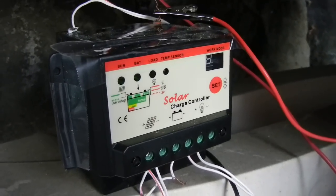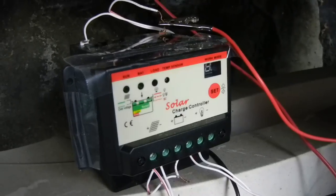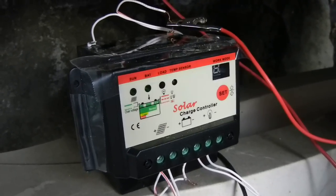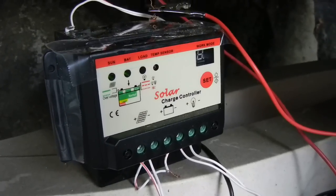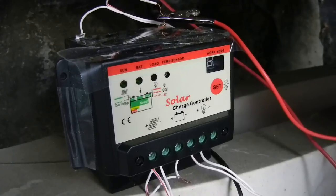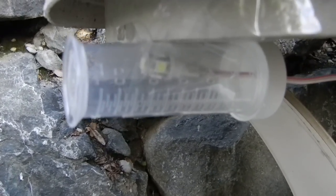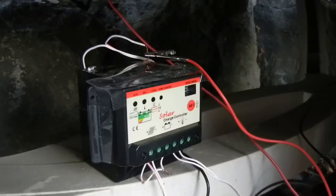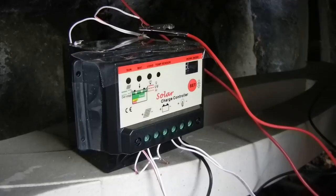I just got a used car battery I had lying around. The charge controller charges the battery but also sends power to a small light, and you can set how long it stays on — like five or ten hours. It essentially makes this into a very large garden light. I have my light over here, which I've switched out to an LED light that only uses about half a watt. So I can have a little bit of light out here during the night, and later I may hook it up to some of my other garden lights.